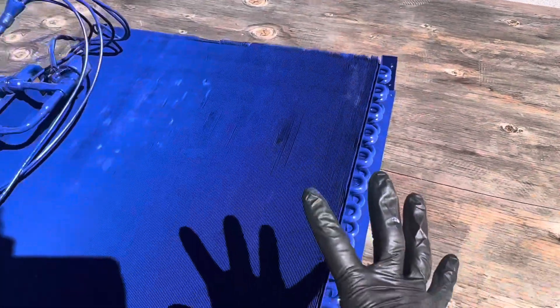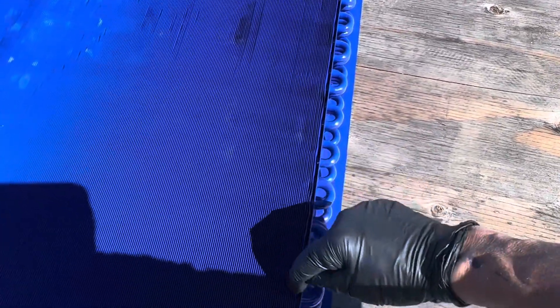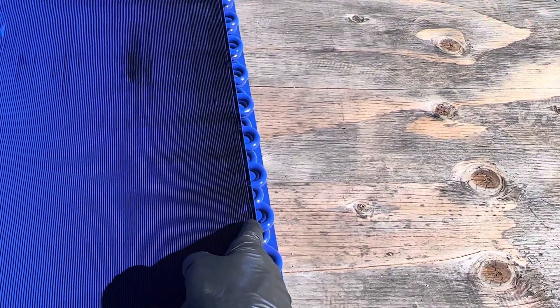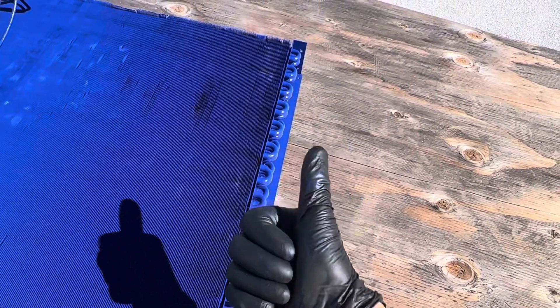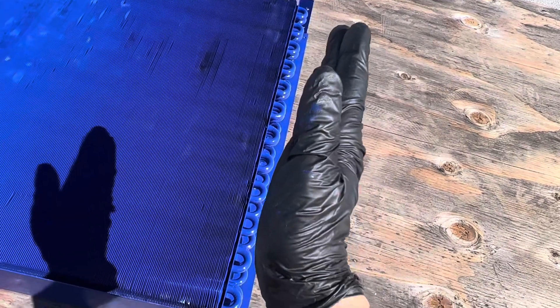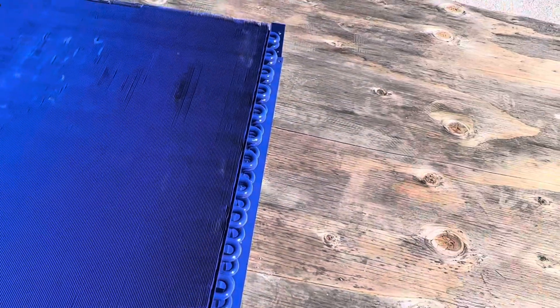After I cleaned it thoroughly and coated it, I made sure I had extra layers on this part. Right down at the junction I actually sprayed directly into the junction, dousing it at this point right in here on top of the plate. So now it's encapsulated — it has no exposure to moisture or any chemicals in the atmosphere. It is sealed, so you can no longer have that galvanic action where it started rusting and the galvanized had worn away.